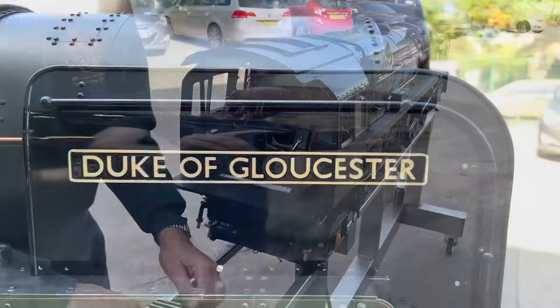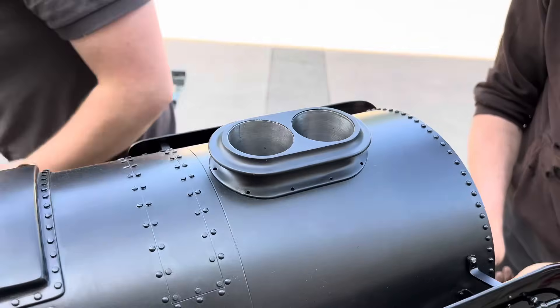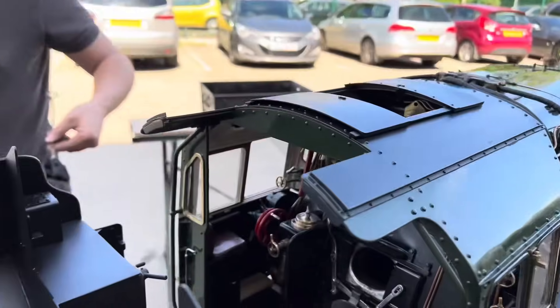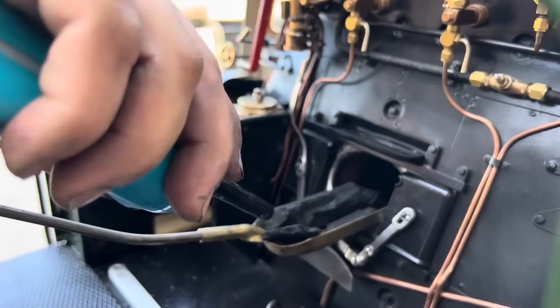The next stage is to connect an airline with the plastic hose here onto the front. We have a little valve to connect it into the steam locomotive's actual blower system, and that allows us to force a jet of air up the chimney. Then John can light the charcoal for the very first fire.